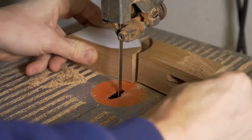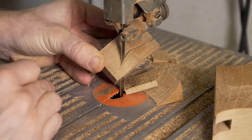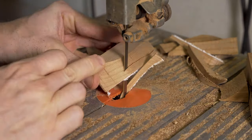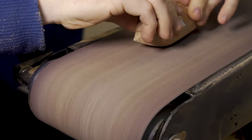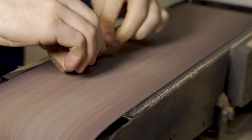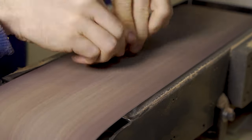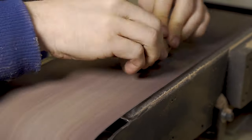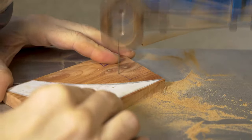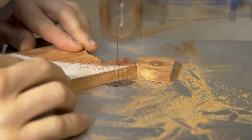A good example for anyone who is new to scroll sawing or woodworking: when you're dealing with thicker hardwoods, sometimes it's easier to cut them out on the bandsaw and then shape them on the belt sander than to get the better quality finish you get with the scroll saw. This isn't a problem for the engines because we were shaping them on the belt sander anyway — cutting at that 45 degree angle on the bandsaw and then shaping on the belt sander. From here we start to look at some of the other parts of the design — the wings, the tail, and little bits of trim we're going to put on the wings as well.